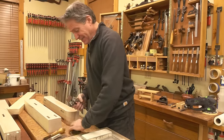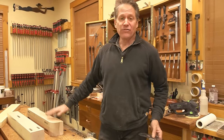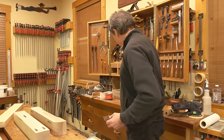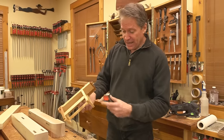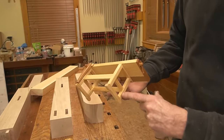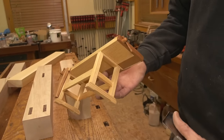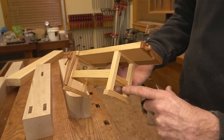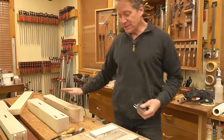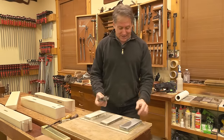The reason I've got this on my mind lately is I've got a lot of soft maple to work and I'm about to assemble the bases of this workbench project. You can see it's hefty, chunky material and I didn't pre-sand it. Before gluing it up, if I can just quickly skim over these inside surfaces it'll be very easy afterward to do any final sanding I need, because these surfaces still have joiner and planer marks on them.